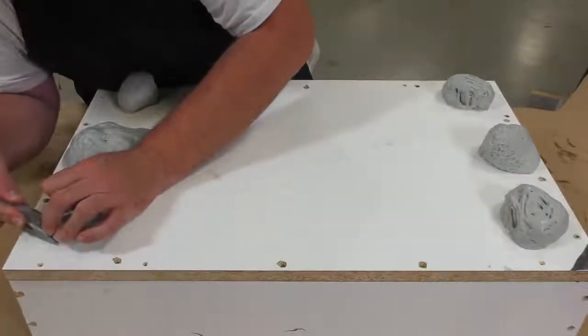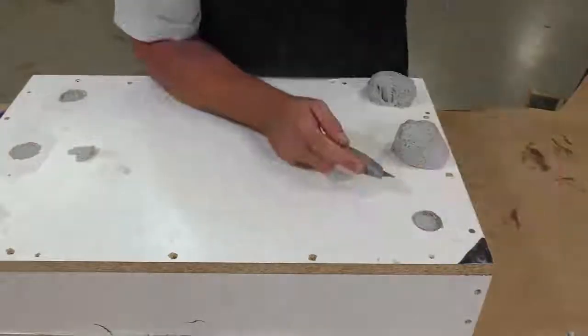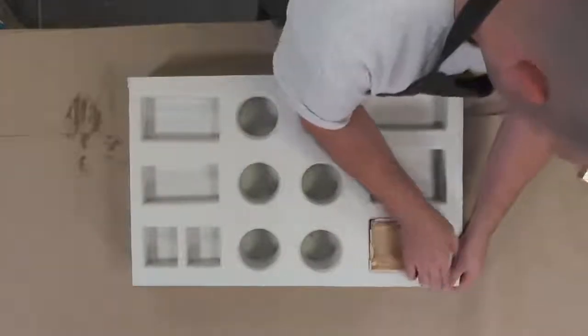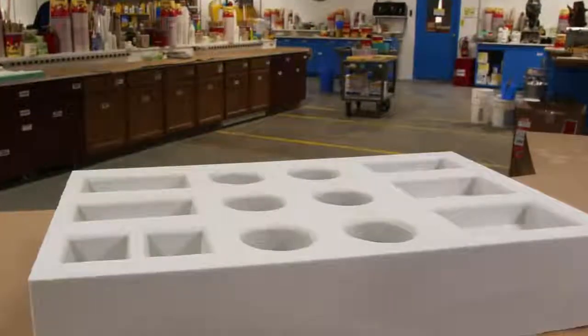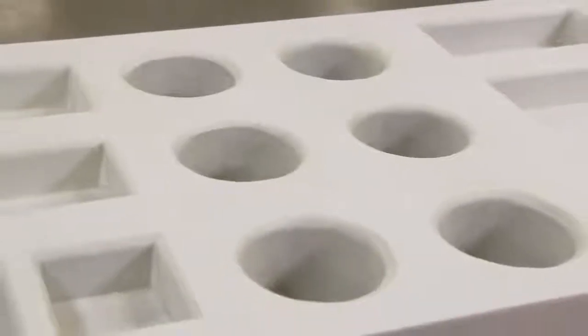After the 2 hours, any of the extra foam that came out of our venting holes can simply be cut away, and then the entire mold box can be taken apart to demold our casting. You want to demold slowly so as not to rip the foam. And voila, here it is. You can see that the face of our casting looks really nice. The cell structure of the foam is very uniform, very even. Now remember, around the hole up top the edges are very soft, and that's where the clay came in that I put around the edges of the blocks as I was preparing the pattern.